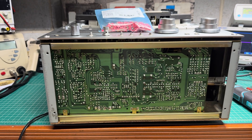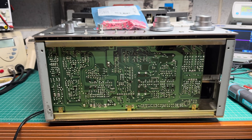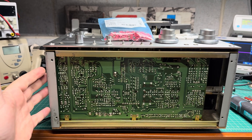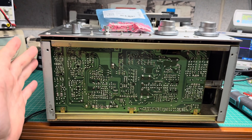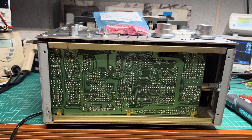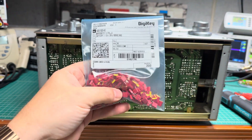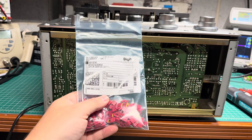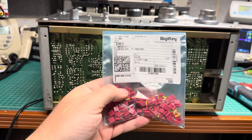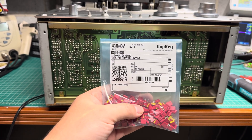This video might be named 'Oops I Did It Again' — I never stop improving my decks to the point where I'm truly enjoying and understanding that I'm pulling maximum possible out of them. What I will be doing today: remember we discussed I cannot replace the electrolytic capacitors, but I can install film capacitors in parallel with the electrolytes to preserve the high frequencies.